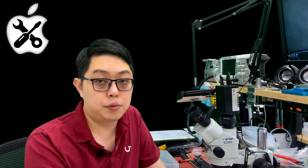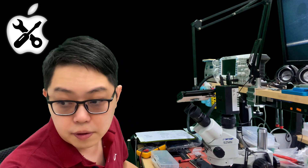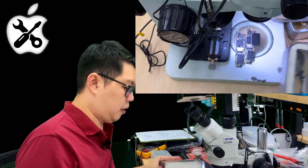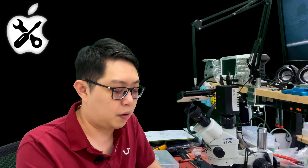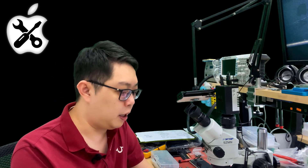You may have seen this kind of tool before — this is the EEPROM reader. An EEPROM reader does not allow you to recover from the damage; it only allows you to back up the EEPROM encryption code into your PC. That file can then be flashed into another EEPROM. But if your EEPROM is already damaged before you use the tool, it is useless.